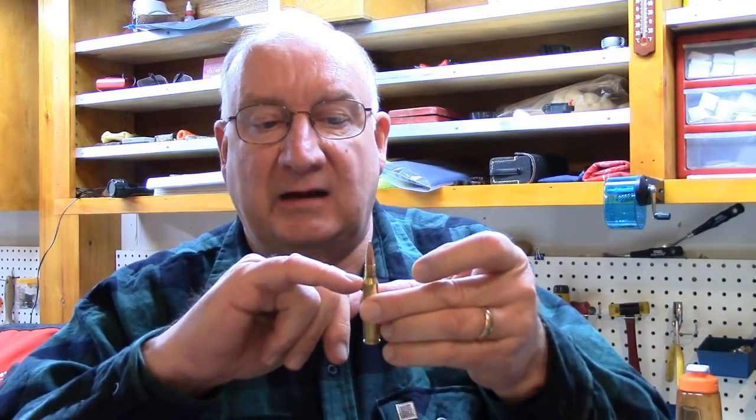So pressure spikes don't even concern them, because they're not working within those realms of dangerous pressure anyway. They're able to seat that bolt down firmly, punch out the best accuracy, and the reason they're seating that bullet firmly is to absolutely ensure that they're actually head spacing on the rifling. That's what they're doing. That's not what you ought to do. Head space is determined by the cartridge datum line or the rim. So don't confuse two issues.